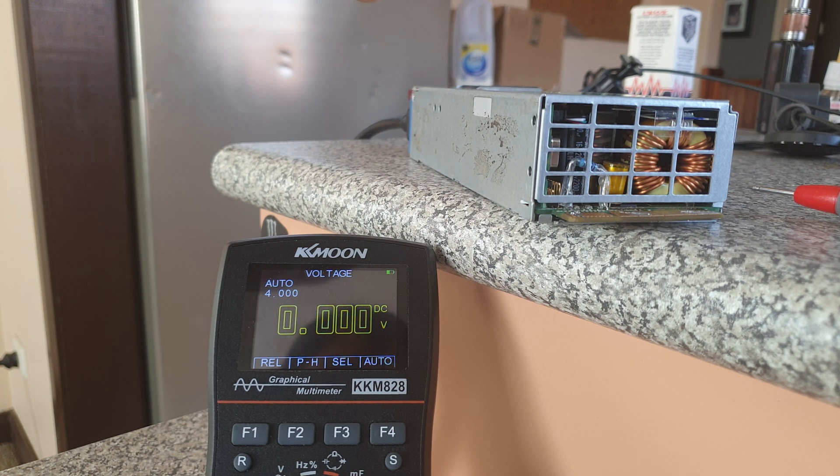But I have made it so I can turn it down if I want to. Basically what I did was set the voltage as high as it would go and then put the resistors in so I could dial it back if I did want to use less than 14 volts later on. So hopefully that has helped someone and I'll catch you in the next video.